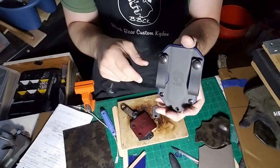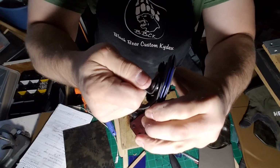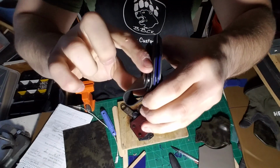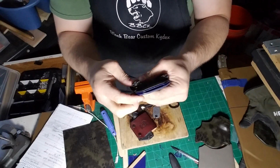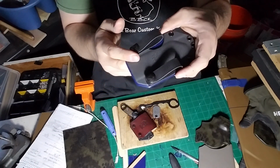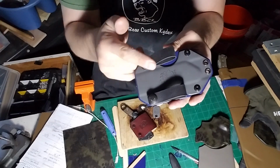If you're not familiar with pull the dot snaps already, they are standard type snaps, but if you check out, I'm putting quite a bit of force on it trying to lift it from below, and it doesn't go. Yet if I lift from the tip, it comes off with relative ease. They are a one-way fastener that has a shaped mechanism on the inside of the snap itself that prevents you from being able to remove it in any other way but the one direction.